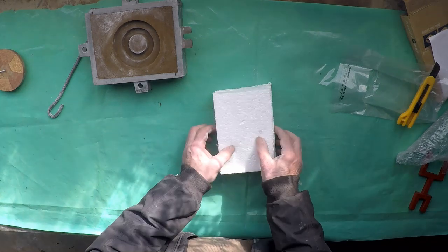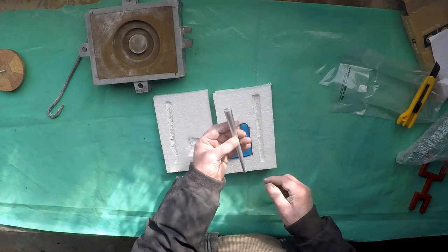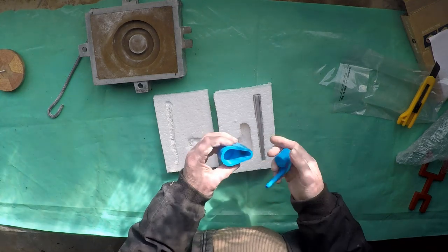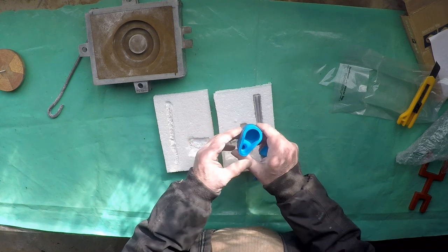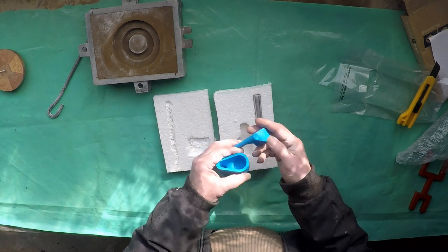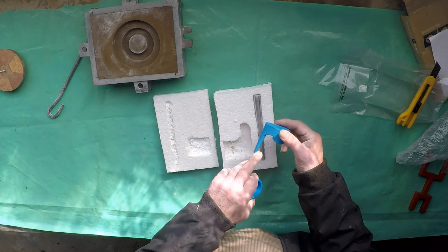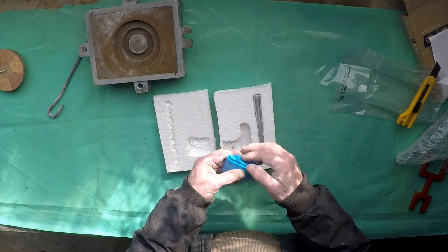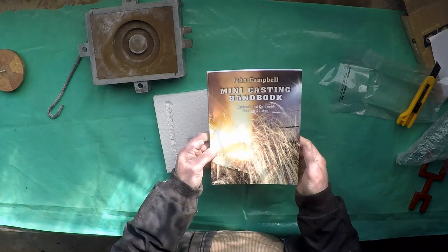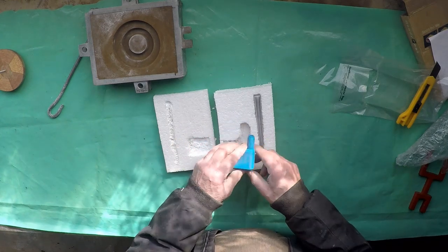Now in return I'm going to send him a pattern for a taper sprue, and also the male and female shape of what a modern pouring basin looks like. This one's fairly small — only 30mm diameter and 30mm deep — and it probably needs to be a bit bigger. But you wind up with this sort of shape where you pour your metal in here, it comes over the top and down to the sprue, keeping the sprue full. If you use this in conjunction with a tapered sprue, you're well on the way to following Campbell's advice, and this sort of thing is instrumental in helping you make a half-decent casting.